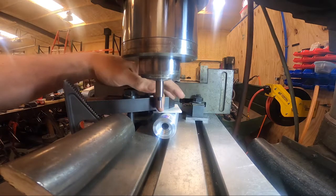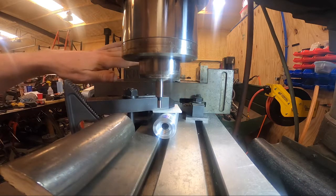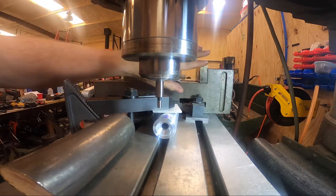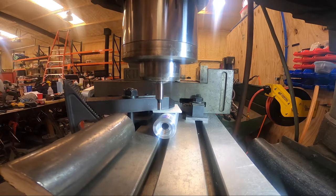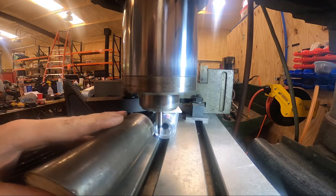Today we're going to show how to locate and drill on the center of a cylinder, and we're going to make a couple of assumptions for today's video. We're going to assume that you don't have a machine vise mounted to your machine — for whatever reason you don't have an already squared object. The T-slots in your machine are squared to the axis, so we're going to indicate using our edge finder. You can use an edge finder on a cylinder, but there are some issues depending upon the edge finder you have and the size of the cylinder.